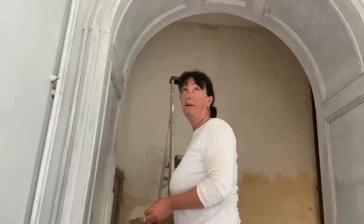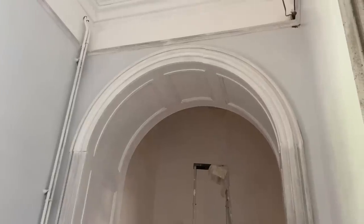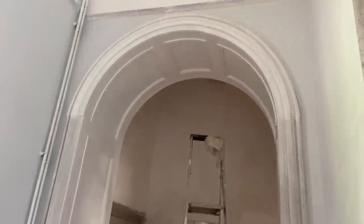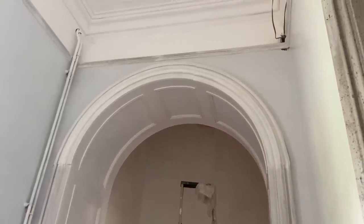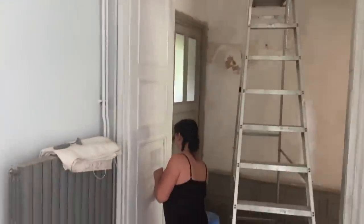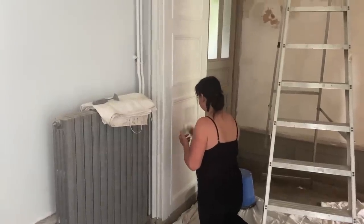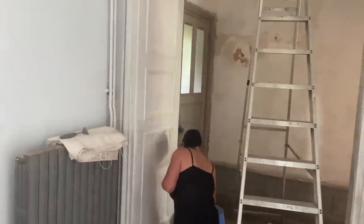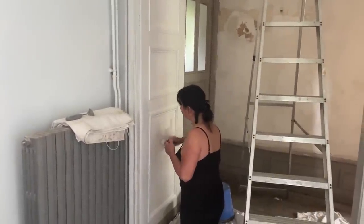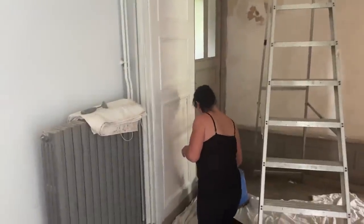It's one of those things you have to think about. While you're thinking, I'm going back to my noggin. What a difference — it's so much brighter down here now. That's the second coat — first coat was the primer, water-based. Second coat is an oil-based undercoat, which makes a huge difference as soon as you put it on. It's so bright down here now — who needs lights in here? It does smell a bit and it takes a lot longer to dry, but we can just leave it and go do stuff in the garden.